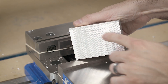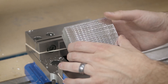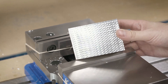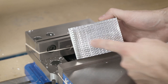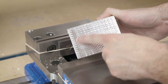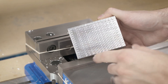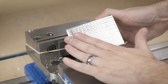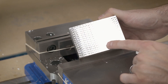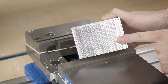Out of all of them, this is the best feeling — the smoothest finish, and a pretty cool pattern as well. Everyone who's a machinist is going to look at this and say 'there's your rigidity.' All of these swirls are basically an indication that this isn't perfectly rigid, but this is a nice finish. It's flat. I don't think you're going to avoid that on a machine like this — this is probably as good as you're going to get.